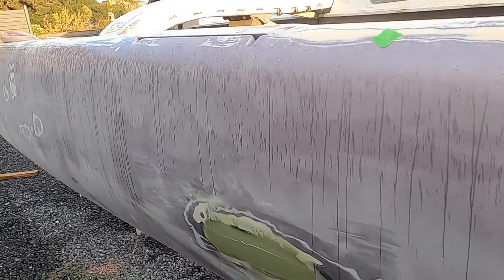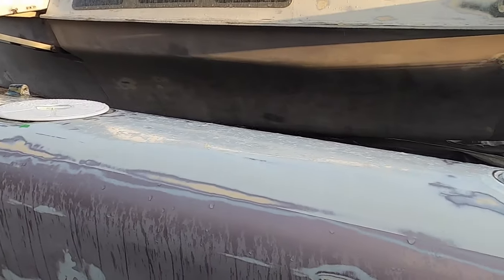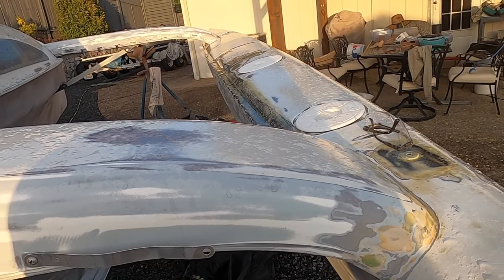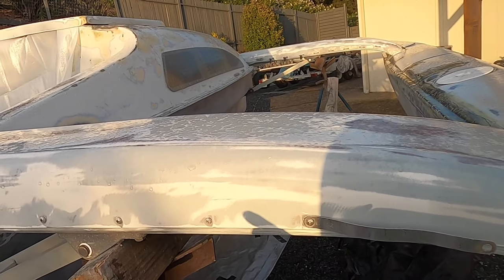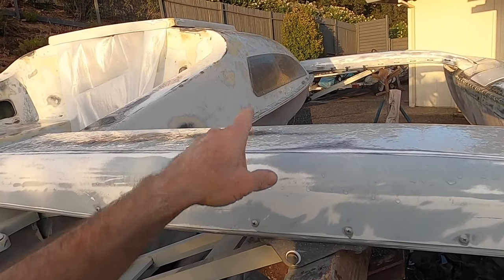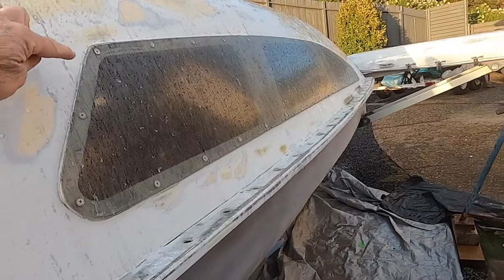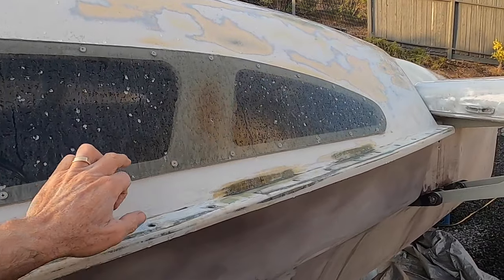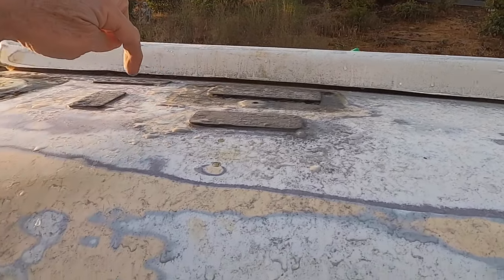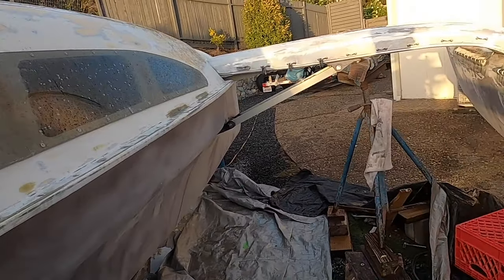I'm about 99% done with the bodywork now. I did find a little bit of hollow still in that patch, so I have one more bit of fairing compound in there — hand sand that tomorrow. To get into primer, we'll do that tiny bit of sanding tomorrow and masking. We have to mask all of this off. I'm going to mask the windows — not remove them — because I'm going to add a black Sikaflex bead around the outside. They were professionally installed; the prior owner told me that. I still have to hand sand the edges of the hardware pads. It's pretty splotchy and ugly — can't wait to see it all monotone gray in the next couple of days.